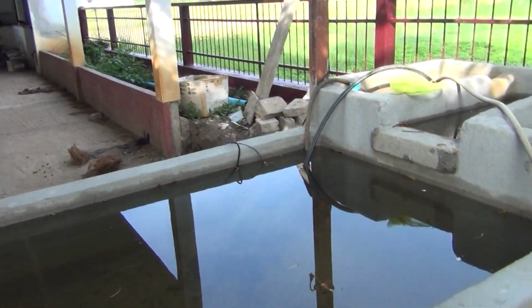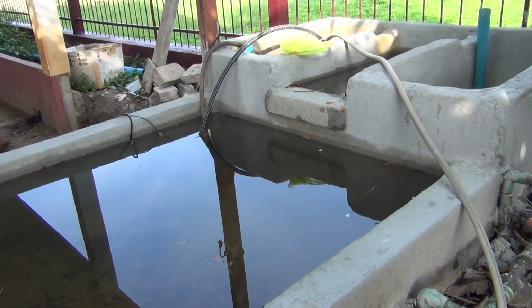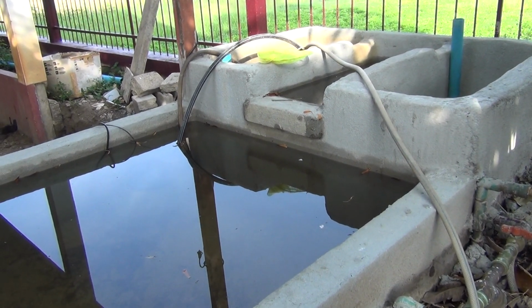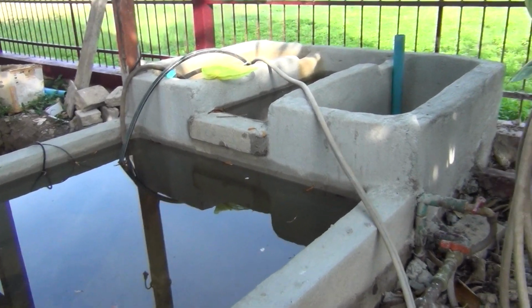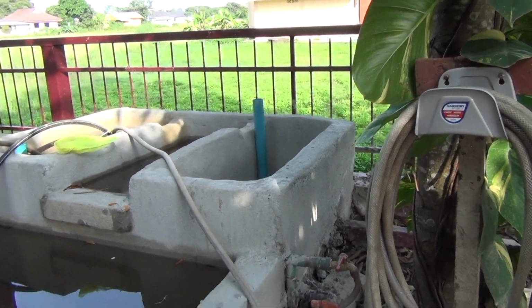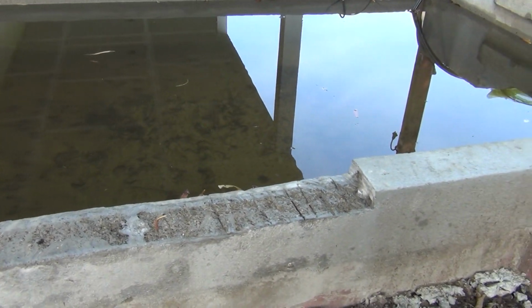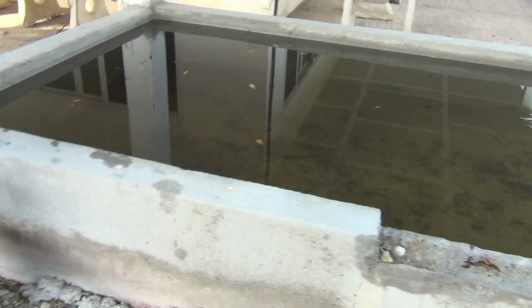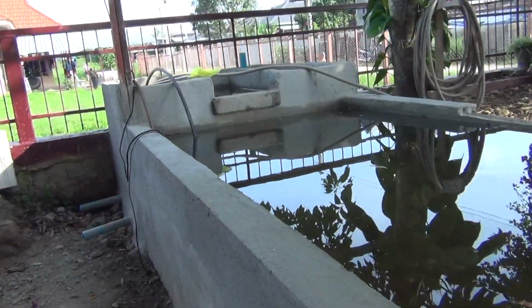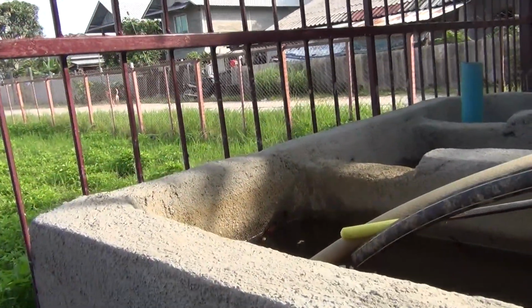we have some stuff, I don't remember what it's called, but you mix it up, and it can be very runny or very thick, but either way, you make it to where it's kind of pasty, and you paint the whole inside of this thing, and that should hopefully seal that. And then while we're at it, since I cut into the cement here, we'll use that and seal this also. Yeah, so hopefully that'll do it. And of course right now, because it's Portland cement in there, you can't put any fish in there.